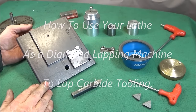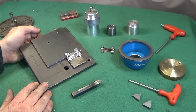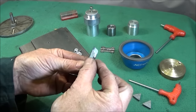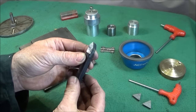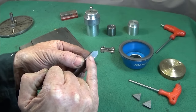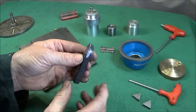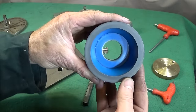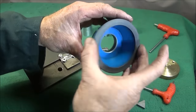I've got another really nice low-cost easy-to-make homemade tool setup to show you this evening. I've been brazing carbide tips onto mild steel shanks like this one here and grinding the angles up on my green grit wheel, but I needed a method of actually lapping them with a diamond lap to finish them off and also to do the radius. First I bought a nice quality diamond lapping wheel on eBay, and if you're going to do this setup you want to buy one like this.